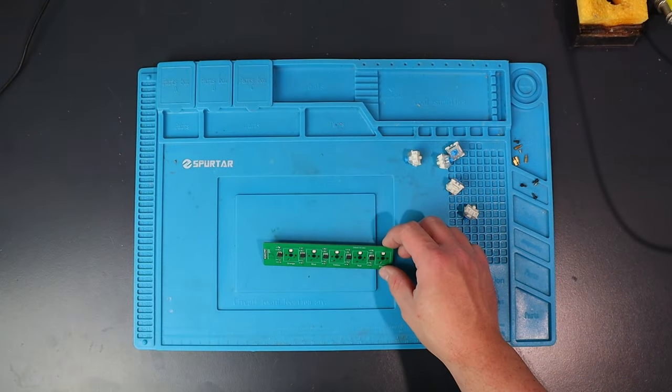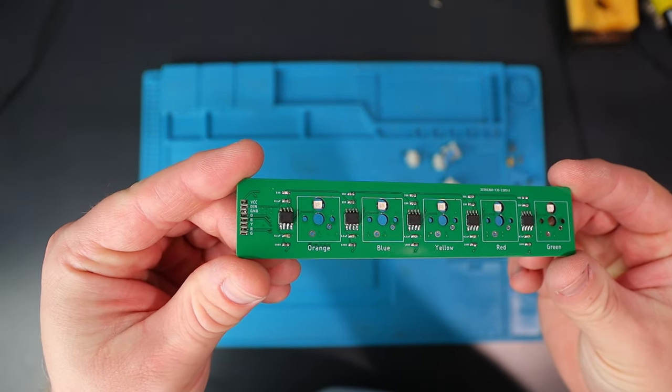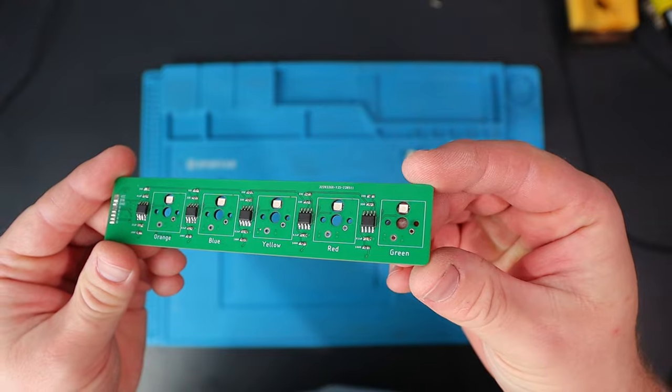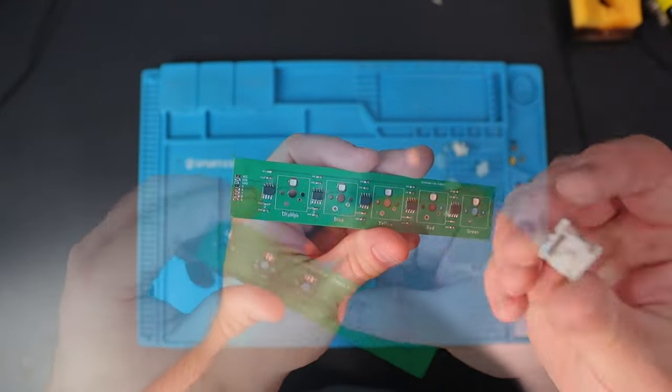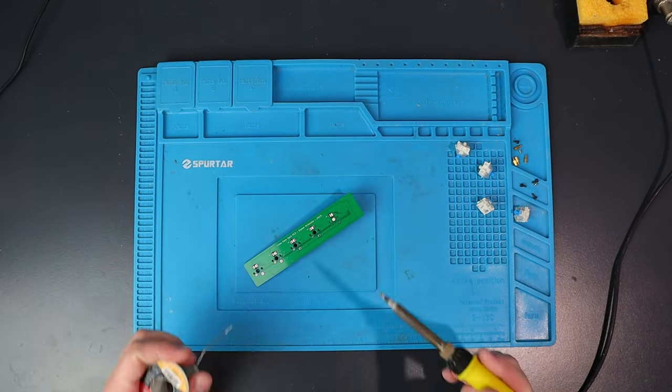This is the new fret button PCB. Of course, I've decided to include some RGB LEDs to light the clear fret buttons up in the correct colours and to allow for effects while playing. I've already populated the surface mount parts, so let's solder the switches in and begin to assemble the neck.